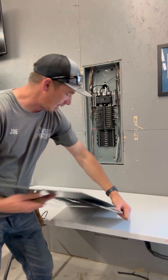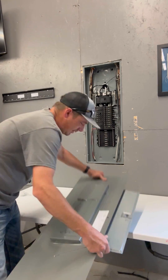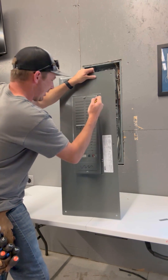On this QO style, what I like to do is take my screwdriver, hook in the back, and lift up. Do that on the last one that you're pulling out. Take some pliers and start breaking those out.